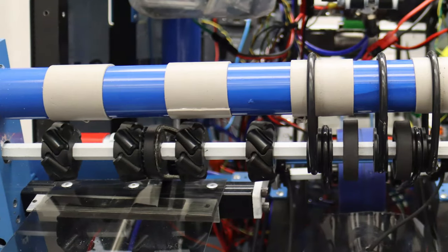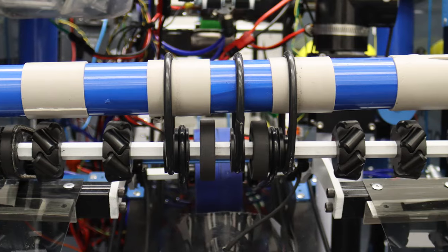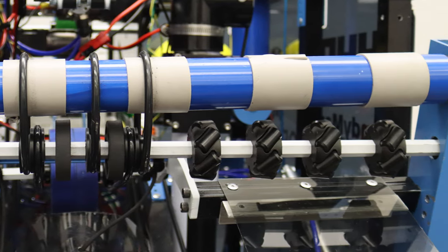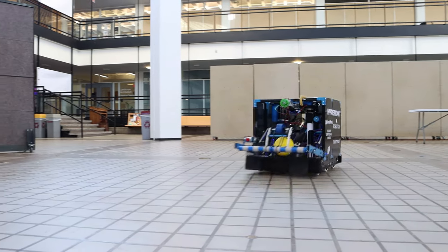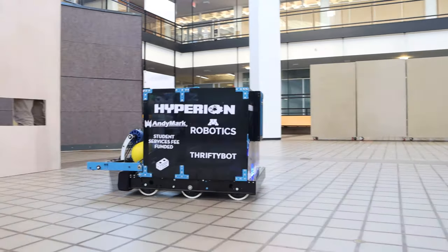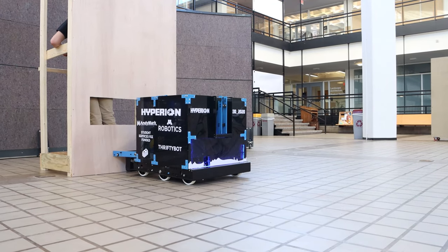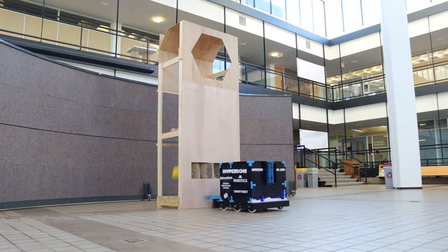The second bar is intended to align the balls into the center so it can funnel into our hopper. There we're using mecanum wheels on the outside and then 2-inch compliant wheels on the inside. Our intake also serves the purpose of lining up against the wall when we are trying to launch balls into the outer goal — both sides of the intake are exactly 12 inches long and perfectly line us up against the wall.